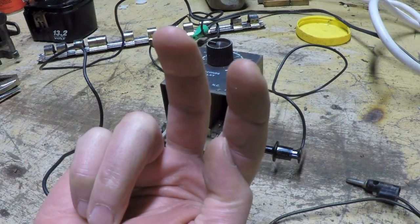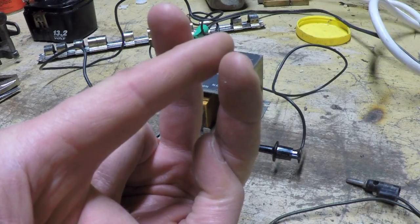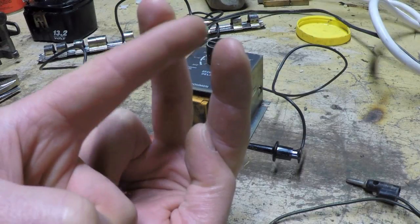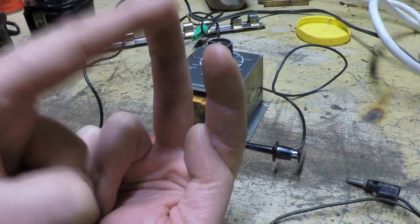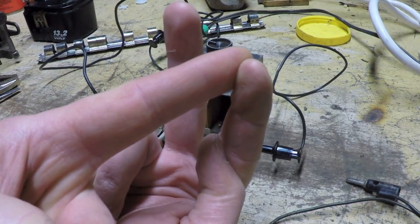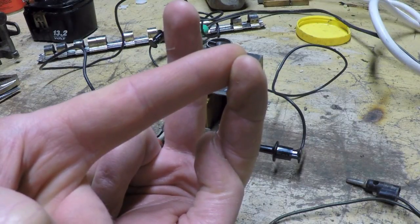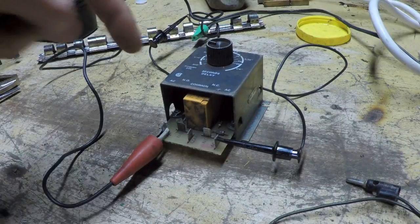Say the points of my fingers are the two contacts, and you've got one moving piece inside the relay that the electromagnet is actually controlling, and under spring tension it's touching one contact when the electromagnet's not energized. When the electromagnet energizes, it pulls that little arm down and causes it to break connection with this contact and make connection with this contact. Follow me? And then of course, if we remove the AC power to the module, the electromagnet loses its magnetic field, and the spring will pull the little arm back up and make this contact again. So that's the basic principle of the relay.